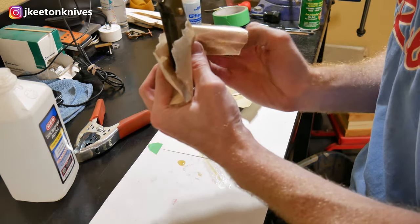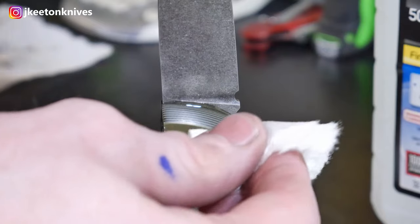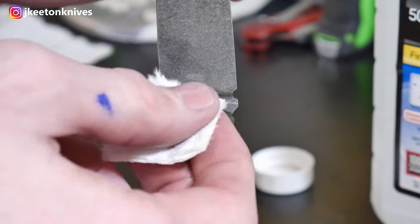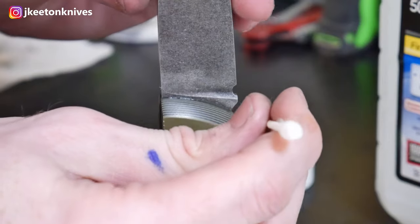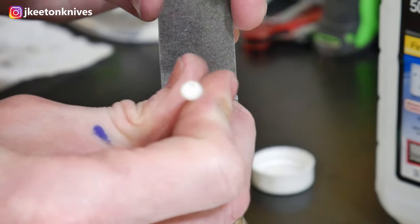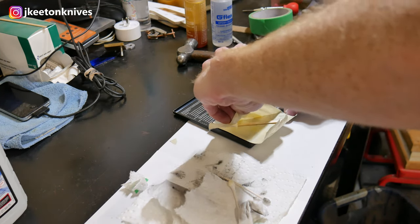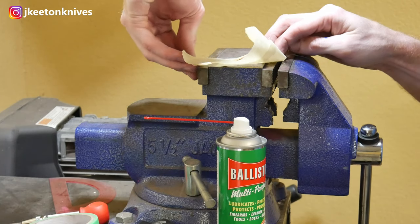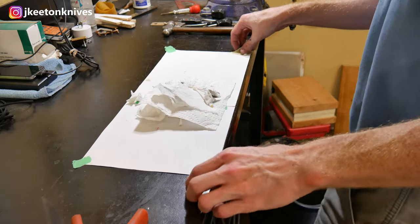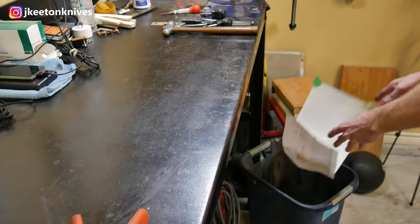I like hammering in that center pin before tightening the Corbys, just so that as the glue compresses it squeezes into all the crevices on the inside. After we get the Corby fasteners snugged up — not too tight, just snug — we go ahead and clamp the blade in the upright position so that I can clean off the squeeze-out on the blade itself. I don't want to leave any glue on the front of the handle scales or in the ricasso area, because that's going to be hard to clean up later. I keep the remaining glue somewhere so that tomorrow I can verify the glue has had time to harden.